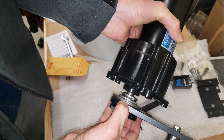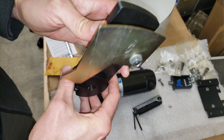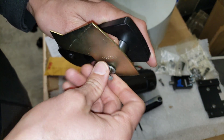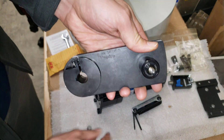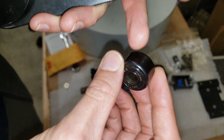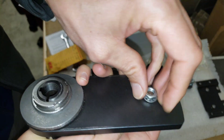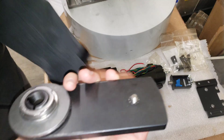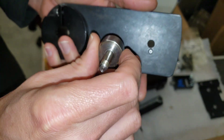The shuttle motor arm has the clutch plate built in. This is the plate that triggers the non-contact switches so the machine knows the tool changer is in the in or out positions. The way this is assembled is there's a nut with a lock washer, then that plate, and behind that is a wide bearing — looks like a double ball bearing with a very wide outer race. On the back side we have a nut and an inner toothed washer. This is the spindle piece; there's a pin to locate it and prevent it from turning so it can control the position of the plate.